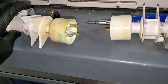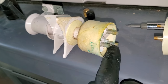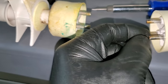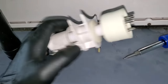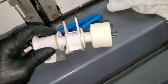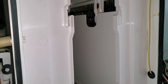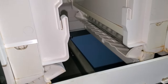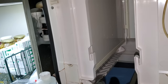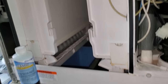We're not going crazy on this — just giving it a good rinse down. It cycled through, I'll rinse that stuff out. But look at the sensors — that's not good. That's probably why my water level was so low. There's nasty stuff on there. We're just giving it a quick rinse now that cleaning is done. I got the water level probes nice and clean on both. I ran some more ice machine cleaner through this one. The water filters are actually bypassed for this one — that's probably why there's so much calcium. The other one didn't have calcium so much as slime buildup, so I just ran some sanitizer through that one.